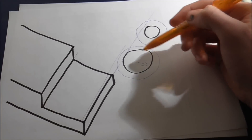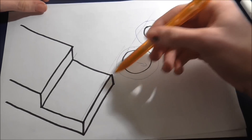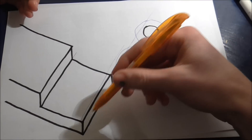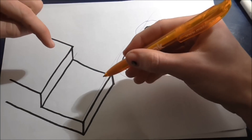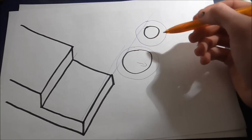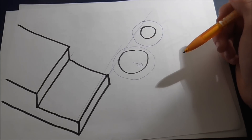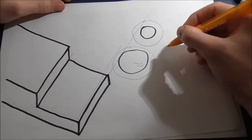The reason you might want to do that instead of altering the program is you may have lots of steps. For instance here I've got three edges I'm cutting, so if the tool diameter is wrong and giving me wrong lengths, all three steps will be out of position. Rather than change all three dimensions in the program to try and make up for it, I can just change the tool and then we're working to the numbers that are correct and the tool is giving us the right size piece.